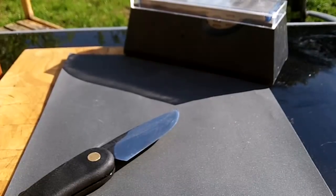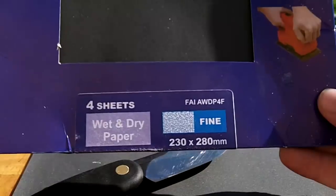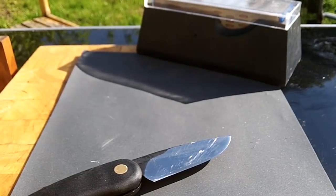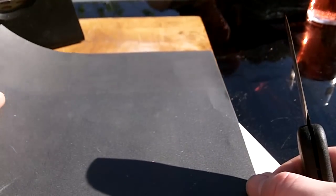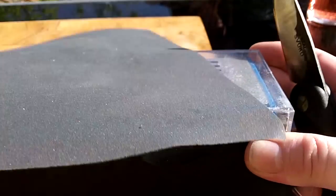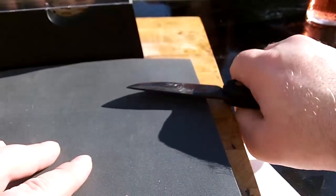The two things that affect our edge are angle and abrasive. What I like to use for a cheap and convenient setup is abrasive sheets — available anywhere that does motor factors or metal finishing treatments. You can get sanding sheets in coarse, medium, and fine, up to about 2,000 grit. My preferred abrasive is wet and dry paper. Use a cutting block so your knuckles can clear the surface. If you're going convex, put a mouse mat underneath the wet and dry paper for a slight bit of give. Don't press down — let the abrasive do the work.